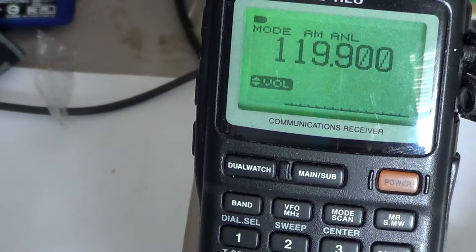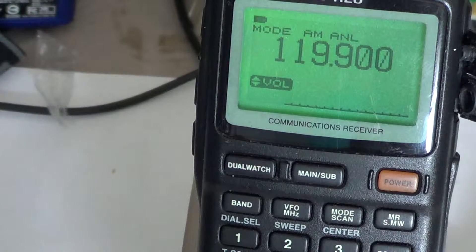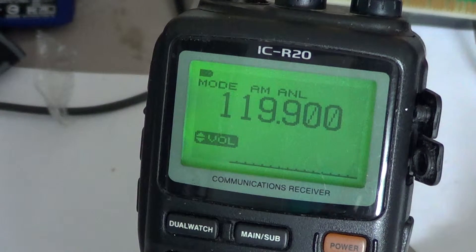In the spectrum of radio communications, this receiver covers a very wide range from 100 kilohertz all the way up to 3.3 gigahertz. The steps used on different communications are not all the same, which can be difficult to figure out at first. You can find charts on the internet by searching VHF UHF tuning steps, but sometimes you'll want to change the step because the signal you want to listen to isn't in that step range.